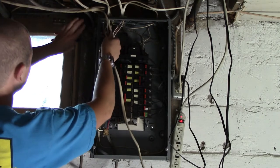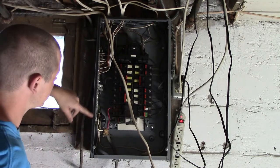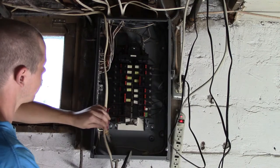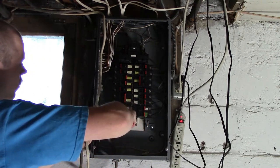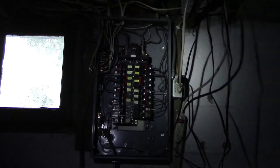I've pushed the wire over a couple of pipes and basically it's going to come running down through this spot right here and into this breaker — a 20-amp breaker that's turned off. I figure if I give myself this much line that'll be more than plenty. It's very dark; I don't know if any of this is even going to show up on video, but I'm going to try my best. Black is our positive — I'm going to go ahead and feed that into the slot there and crank that down. Technically I think you're supposed to put the neutral and ground in first, but obviously I didn't.